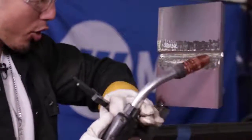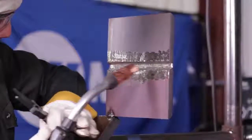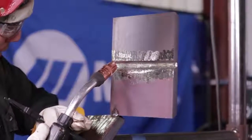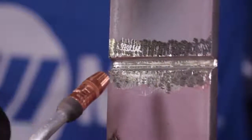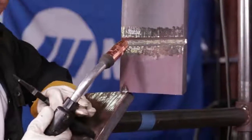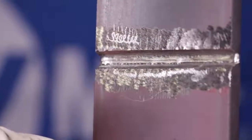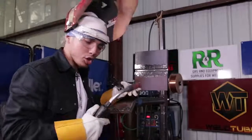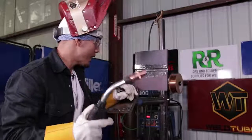When we're going, you can either push, you can pull, you can drag — I recommend going this way. What I'm going to do is 1, 2, 3. If I angle it down like this, everything is going to fall down. Again, you're playing with gravity here. Make sure you're favoring your gun towards the top side of the bevel, all the way through. You can drag it as well. After the hot pass, you could just drag it all the way. We're going to turn up the heat more and more, but right now we're going to do the flux core fill, hot pass fill, and cap in the horizontal position. Let's get to it.